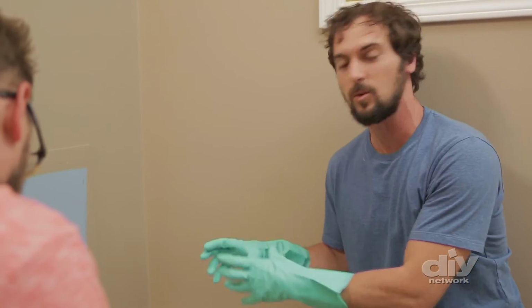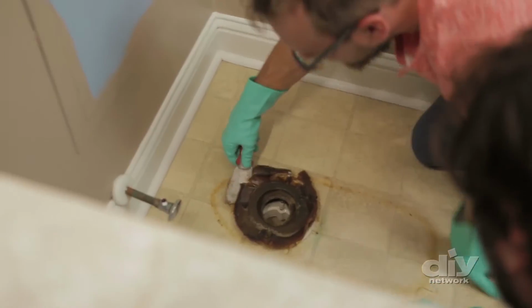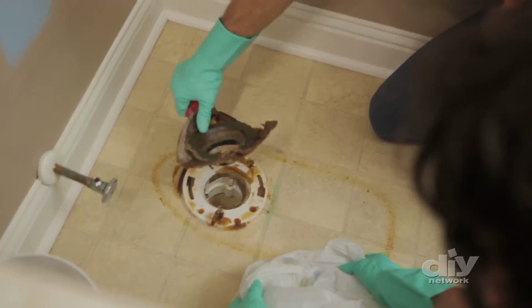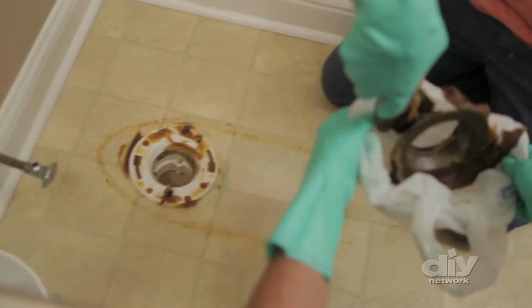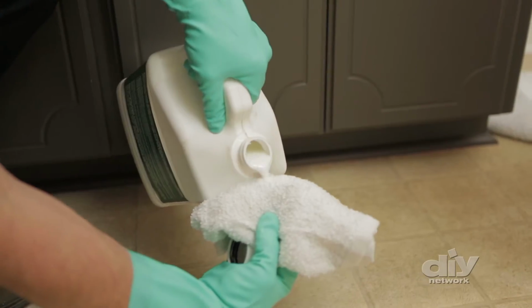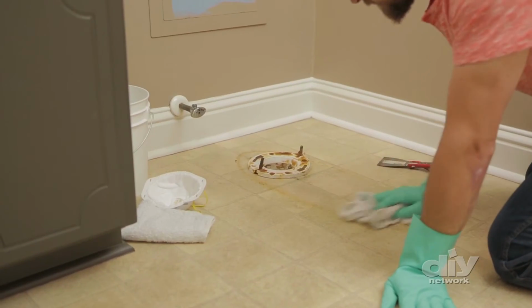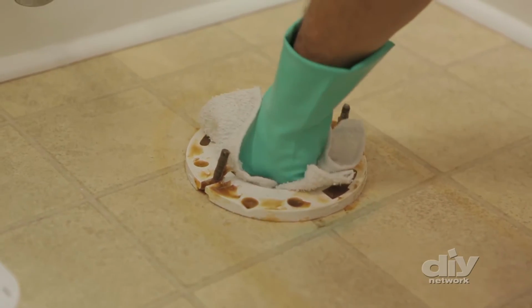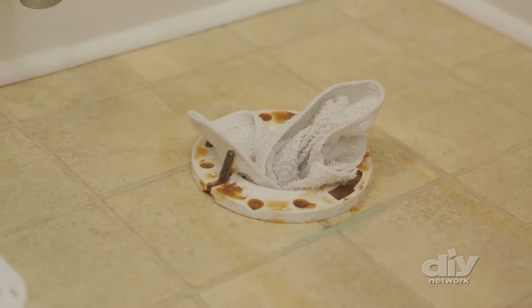This is what seals the toilet to the flange. Get rid of the old one with the putty knife, and trust me on this one, you're gonna want gloves. All right, and I like to keep a plastic bag around just to take all the old wax out and dump into. As soon as you force your brother to scrape the wax ring off and clean the entire flange area, go ahead and tell him to take an old towel and wad it up and plug the hole so that the noxious fumes don't make him pass out.